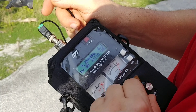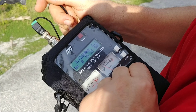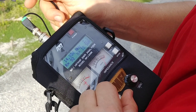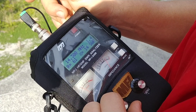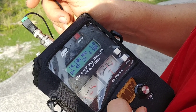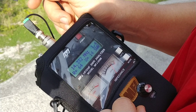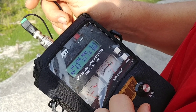So let's go to 14 megahertz. At 14,300 it's 1.3. Down to 1.1, then 1.0 at 14,100. So 1.0 on 20 meters. In the CW part, around 2.3, 2.4. Not bad, right?